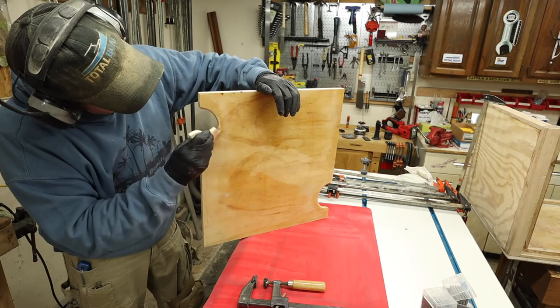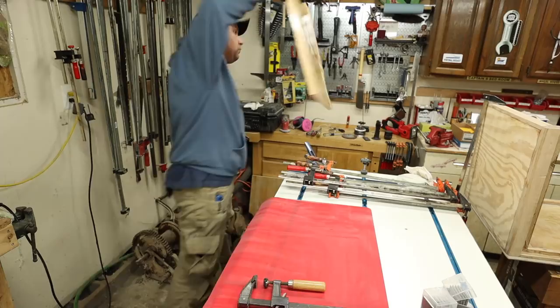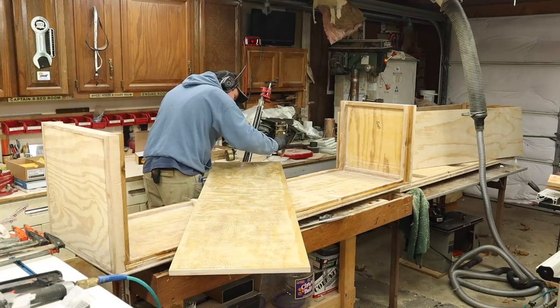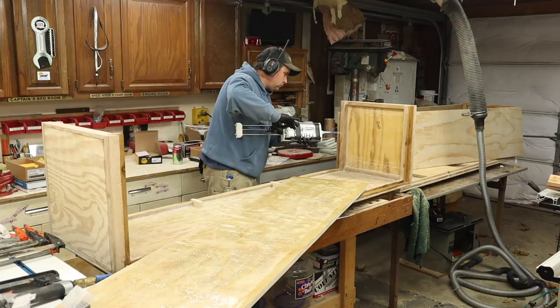We used plenty of Thixo and regular unthinned epoxy for the assembly, and I'm very pleased with using that Thixo on the inside of the tank to soften those inside corners. Like we've said before, no finish likes sharp corners, and epoxy is no different, so we want to ease those corners inside before we apply the glass tape and several more coats of epoxy.